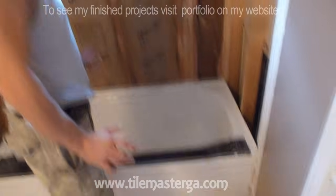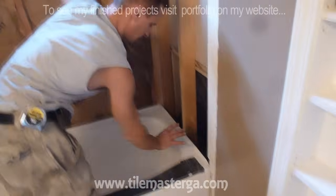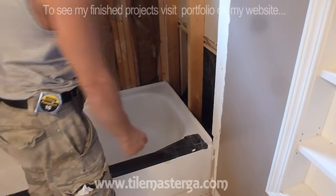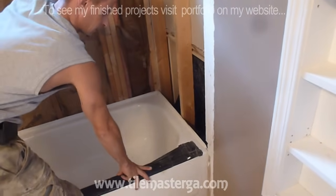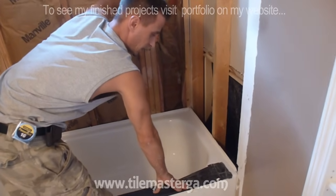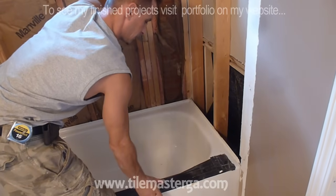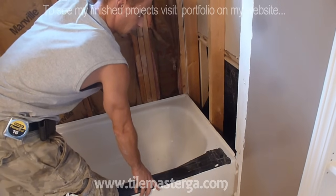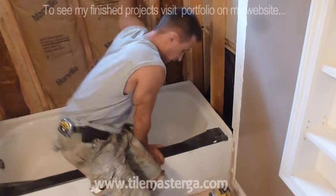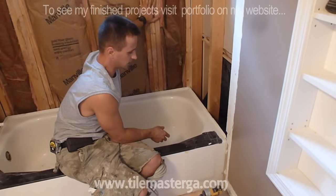The tub is disconnected from the drain. This is not cast iron — this is a steel tub covered with a thin layer of porcelain, kind of glazed, so it's not as heavy. The way this one will be removed, we're going to lift it — most of the times one person can do it. If we're dealing with a cast iron tub, you won't be able to just lift it this way. Cast iron has to be busted into pieces and the best way is to use a sledgehammer to break it. Next time I'm dealing with cast iron I will show you how to remove it, but it's pretty much the same steps — the only difference is busting it into pieces instead of lifting.